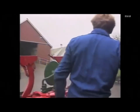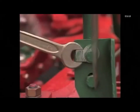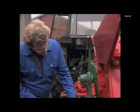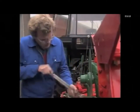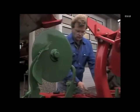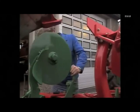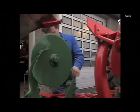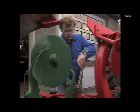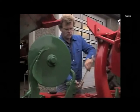The majority of plough adjustments can be made prior to commencing work. Disc coulters are the first adjustment. Make sure that they are set to a minimum of two centimetres wider than the width of cut and parallel with the land side in an upright position. On lighter soils or for deeper ploughing, it may be necessary to move the disc coulter further out to maintain a clean furrow wall. The depth of the disc coulter is then set so that its distance from the share is approximately five centimetres. This distance may have to be increased when working in hard or stony conditions.